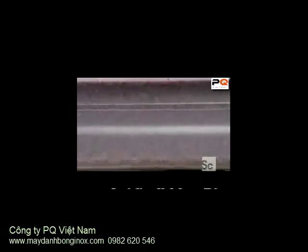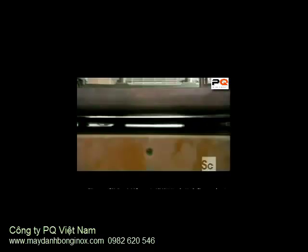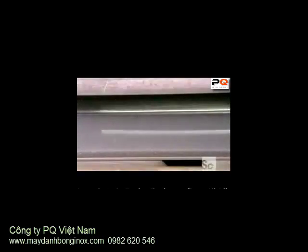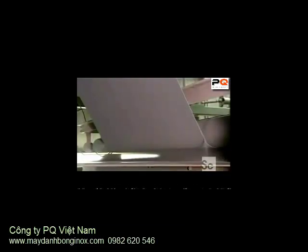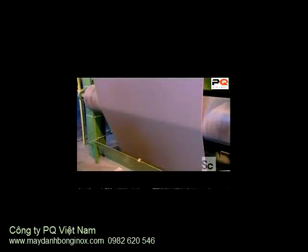Once airborne, the abrasive grains stick to the adhesive-coated cloth and become embedded in it. This method allows for even distribution of the grains across the cloth. The grain-coated cloth now rolls out of the pit and back up to the main level of the factory.